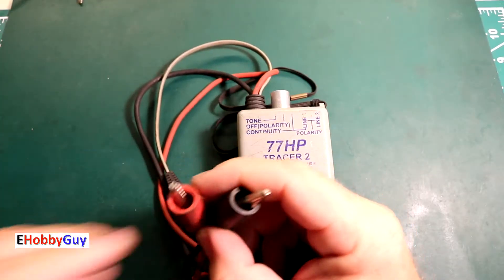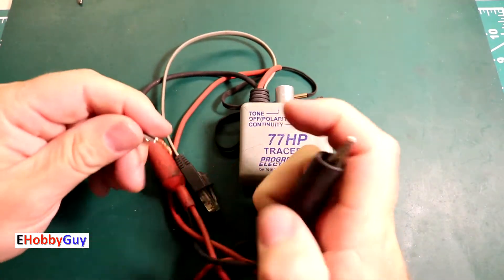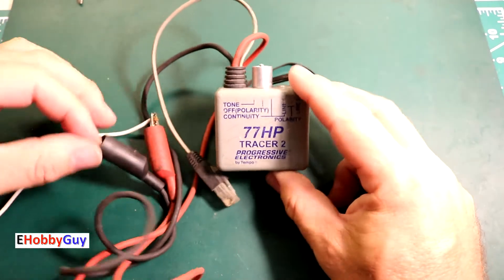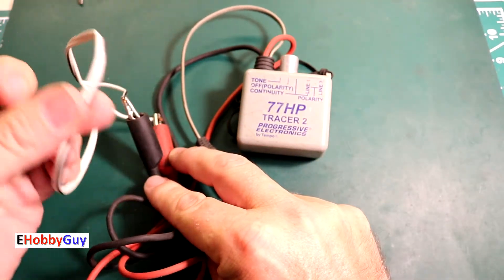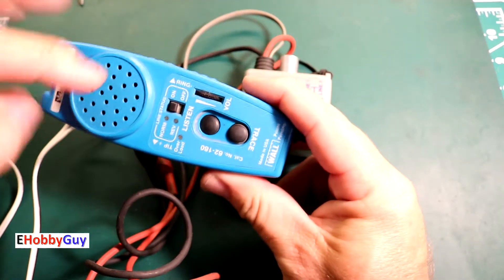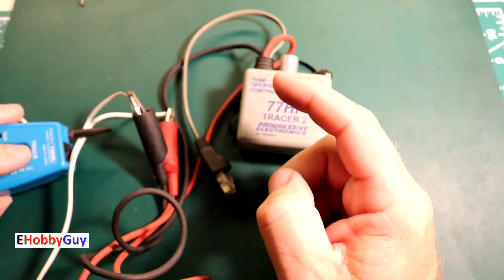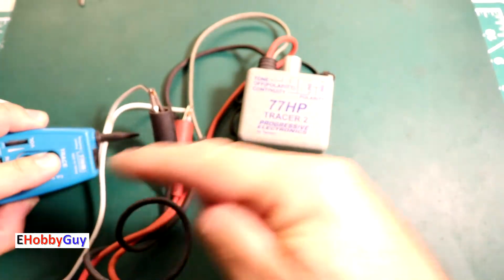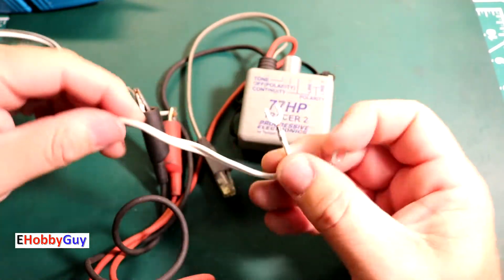You clip these two clips onto one end — here I have a piece of wire. Making sure there is no voltage on it so it doesn't feed back, it generates a tone and pushes it out through these two wires, conducting its way through. Then you would hunt out the wire with something like this, which has a little speaker. When you press the trace button, there is an antenna here and you hear the tone on the other end.